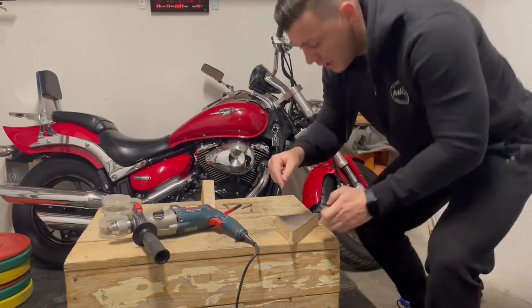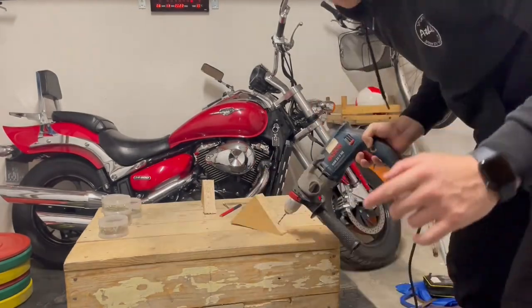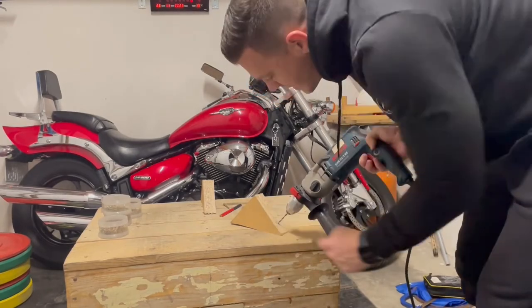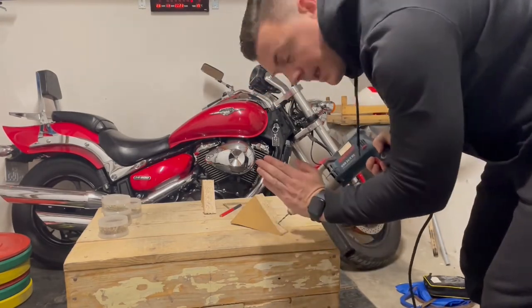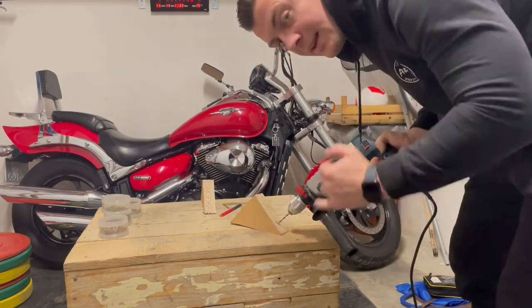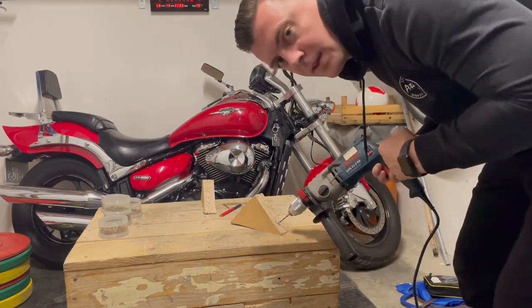You want to have it angled normal to this side, because this side is going to come to the table side. So when you put the screw in this piece, you want to have it parallel to the table side so that the screw can easily go into the table side.